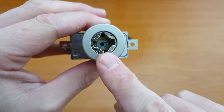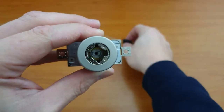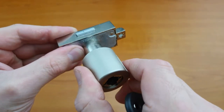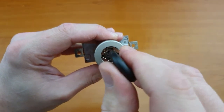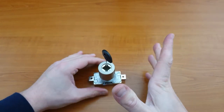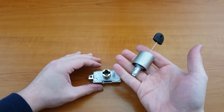But we also need to get the handle off. So you can see inside that shape there's a hole — this is where we need to put our removal pin in. First of all turn this to the open position. Now take your removal pin, put that into the lock, press down until you hear and feel a click, and now you can take the handle piece off.